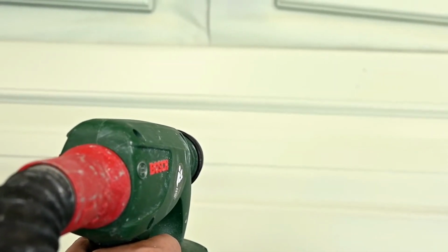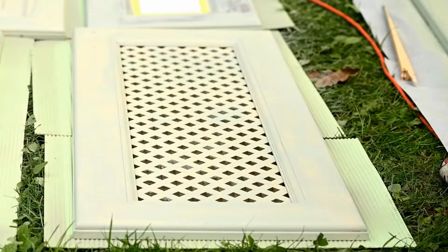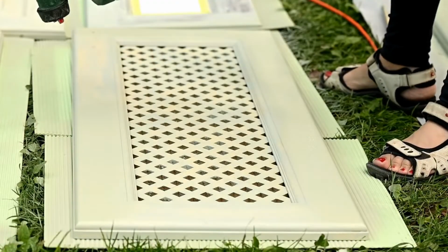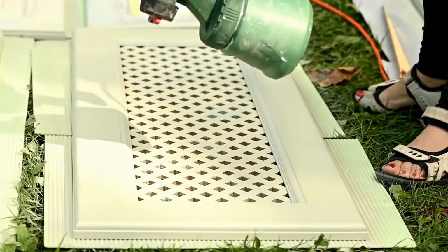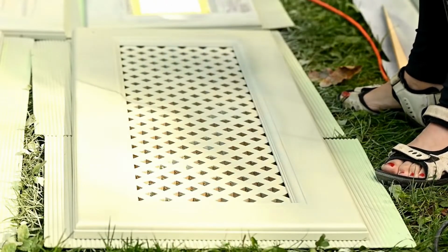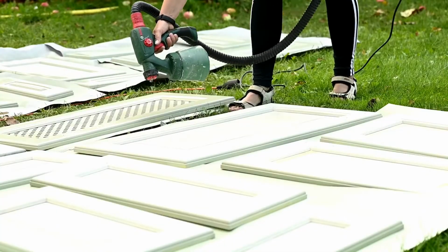And secondly, wax itself is still a much more delicate coating than other sealers. You can use wax for a nightstand, for a chest of drawers, but for a kitchen where we wash, clean, rub off, wax will not last long, no matter what manufacturers and marketers tell you.